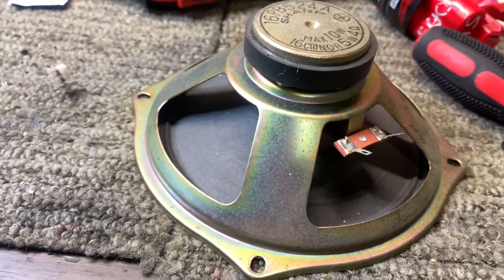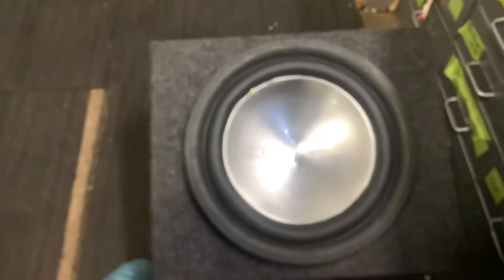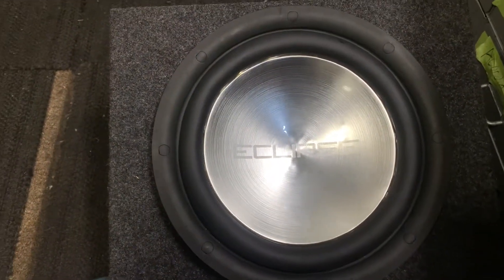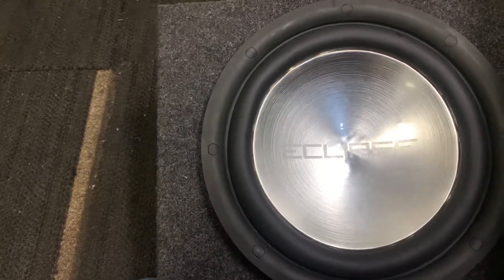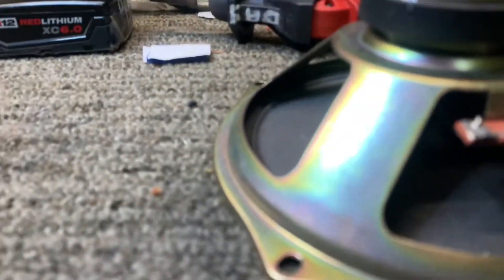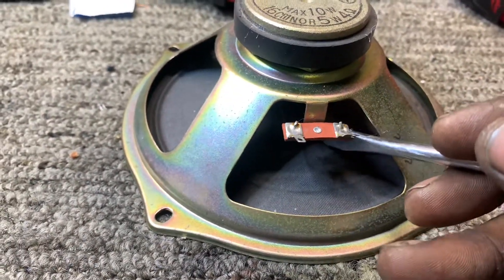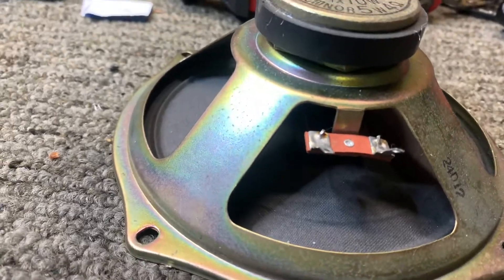It's a real simple fix — just something to check before you toss the speaker in the garbage. I just fixed a 20-year-old Eclipse 12-inch in a sealed single-enclosure sound quality subwoofer that I thought was broken, sitting in my parents' basement for the last 20 years. It turns out it plays when you press on it or at high volume. I popped it out and found that one of the two voice coils had a bad connection at the terminal. I was able to confirm that by manipulating the wire, and it would beep intermittently. Thanks for watching — be sure to like, comment, and subscribe.